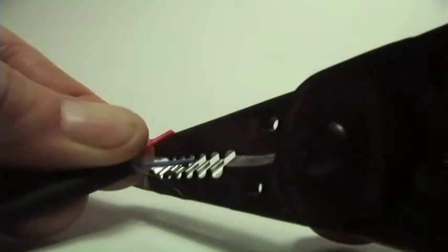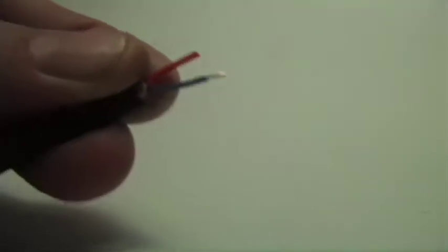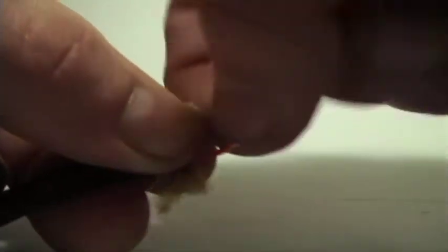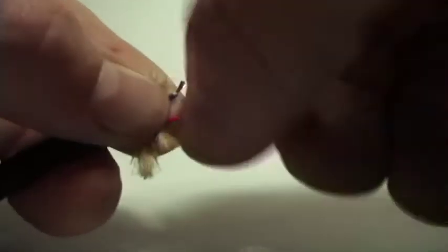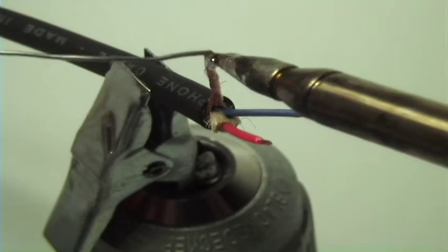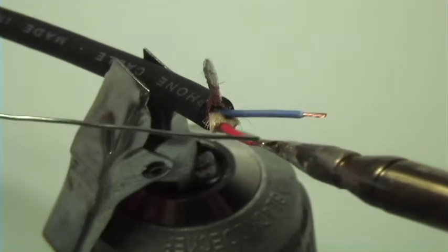Now for the sake of the demonstration, we're going to use the cable that's made in USA. Now we're going to strip off the ends of our wires here. We're going to want about an eighth of an inch to a quarter of an inch exposed. Now we'll do the other wire. Here's what our ends look like — we're just going to give them a little twist to tighten up those strands. This is where the helping hands come in. It's really easy for something else to hold the cable for you. What we want to do is we want to tin the ends of the cable here. This makes the process go much faster.